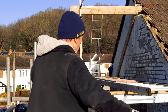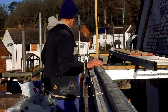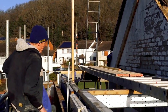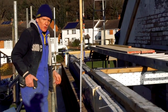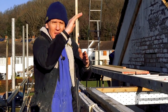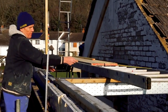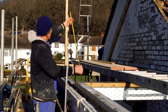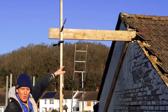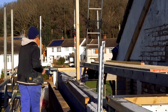Let me just explain this. Here is the back of the house — we can probably reference a drawing at this point. You can see this is the square room here. From the square room we suddenly change to a roof that goes up in line with the pitch here. In order to get this roof in line with that pitch, we've had to break those tiles off, because it was very difficult to see the line of that rafter with those tiles on. What very often happens with tiles is they kick up slightly, so you need to find out where that rafter is running in there. Now we've found the rafter, we can line all our rafters in with this rafter up to the ridge plate. That ridge plate is set below the roof line up there because we don't want it poking out, and it's set halfway between this wall plate here and this one.